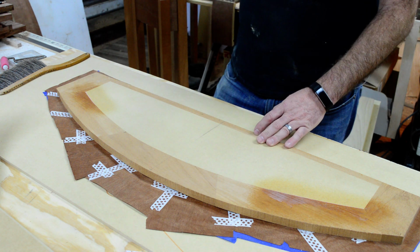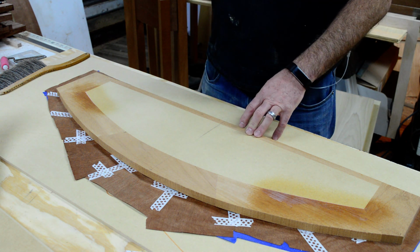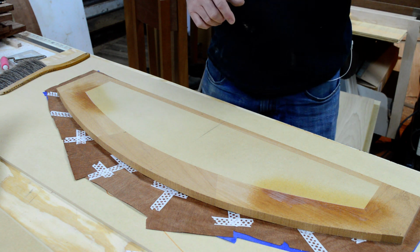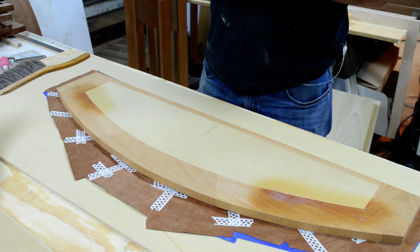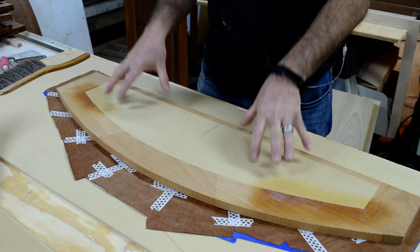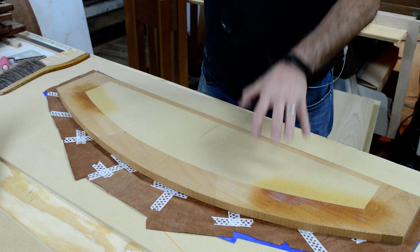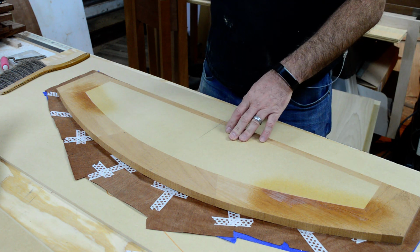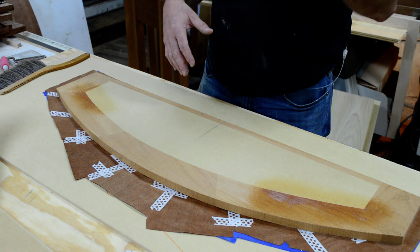So the vacuum bag has a platen. It's the stuff with the grid work you'll see here in a second. What I don't want to do is feed the substrate with the veneer into the vacuum bag, because this stuff is going to start to catch on that grid pattern and it's just going to create a big mess.